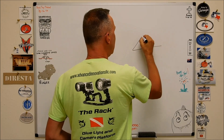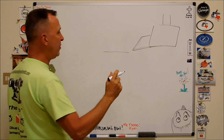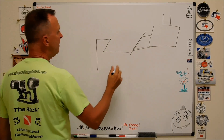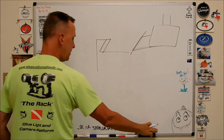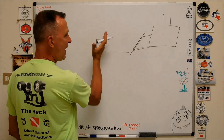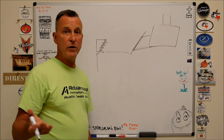There's your cutter — got a nice sharp point on it, relief here and here. As you get to the end of that plastic part, this geometry right here is going to translate to the cut. As this cutter moves across, forming that particular undercut, as the undercut gets over here and the tool starts to reach the end of the cut, you have more surface contact against the face of this tool than you have support. So that surface becomes the dominant surface, this little web is no longer dominant, and when it cracks — boom — the corner of your part is going to go because this big monolith on the top just pulled it off as a matter of force. There's no way around it with that tool.